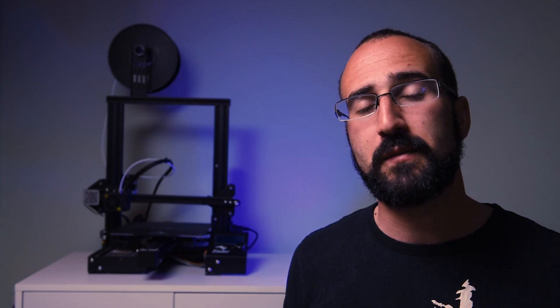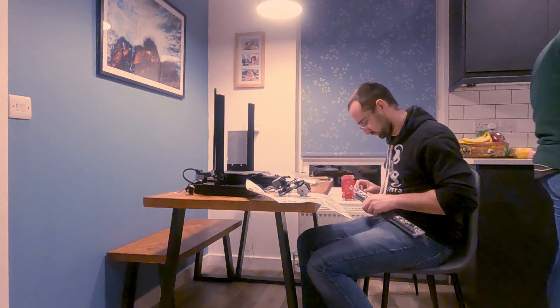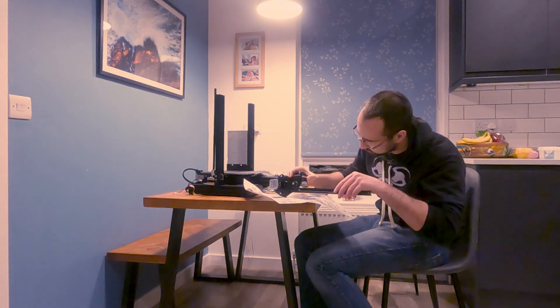So what are the downsides? For me the first downside was that I had to put it together myself. This actually took me about 4 hours because I did it wrong — I put the extruder on the wrong way so I had to take it all apart and rebuild it again. It was a bit annoying but once it's done, it's done and you don't have to build it again. The second thing is that it can be quite difficult to problem solve. When I first started, some of my prints came out quite bad and I didn't know why — it was because of a little belt going across here. All I had to do was tighten that belt, but to problem solve that I had to spend about 2 hours printing something to see what was going wrong, then tweak something and wait another few hours for something to print.